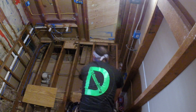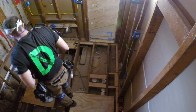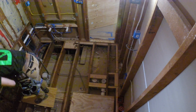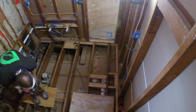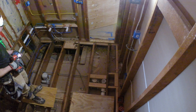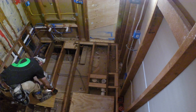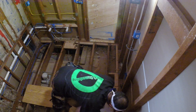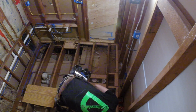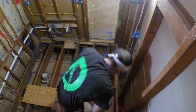Make sure you get the correct screws. On most subfloors, I either recommend star-type head screws that are construction-grade and made for non-load-bearing applications, or you can use deck screws. I prefer the construction-grade screws that have a self-tapping head — it really helps you get them in without pre-drilling every hole. You can screw them right in; the heads won't strip for the most part, though I do get a few that snap here and there.